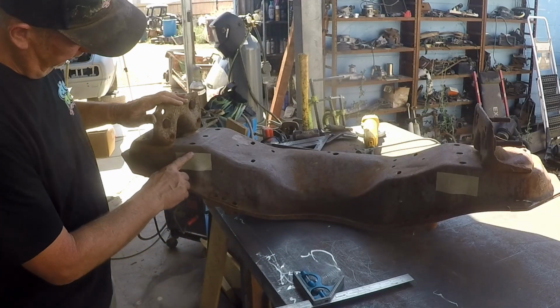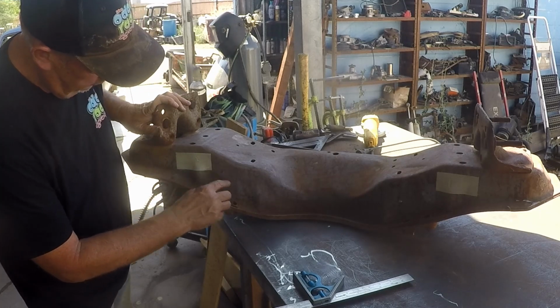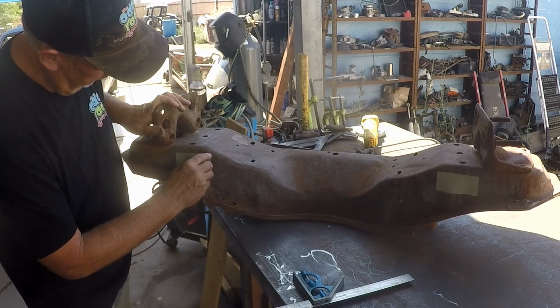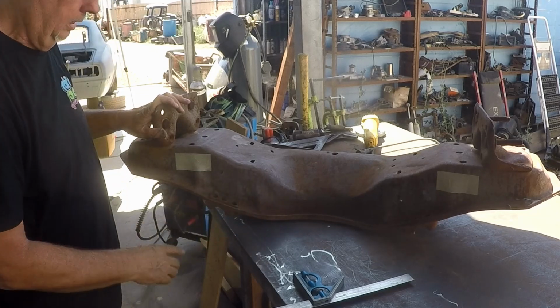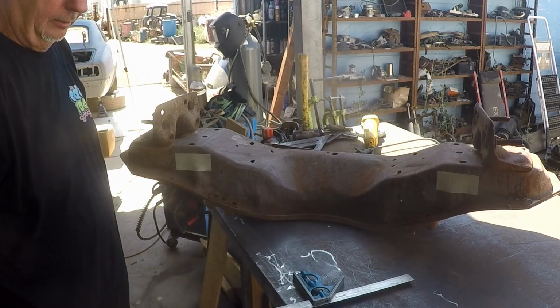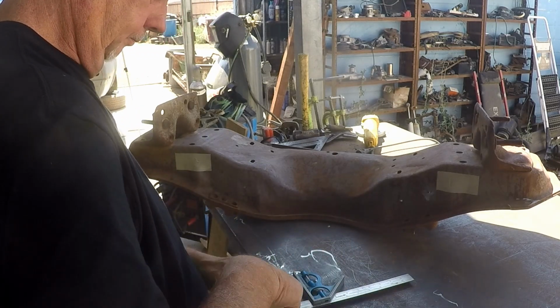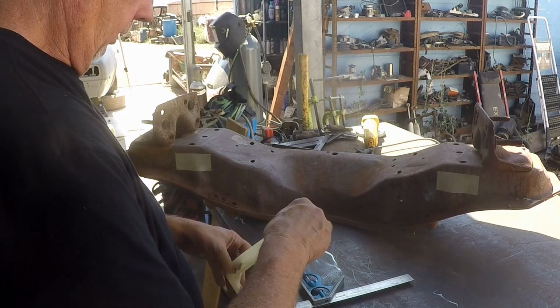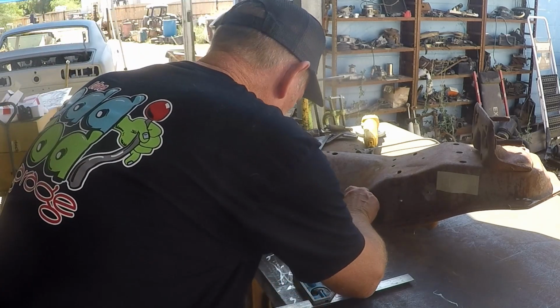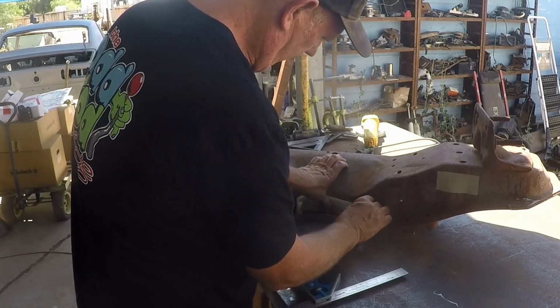So that's why when we cut and we square this off, we're gonna go from that point right there to our lower point down here, that point right there to our lower point down there. And we don't care what our dimension is here, all of that will transpose straight down. So we're gonna get another 1.88 across here. And we'll do the same exact thing. Now on this one, it's pretty much down in the corner. And this is the hardest part of it right here.